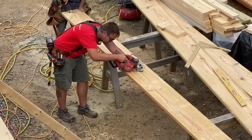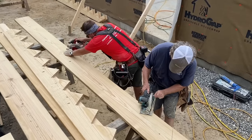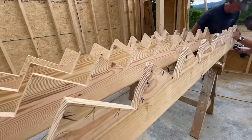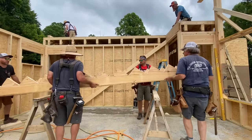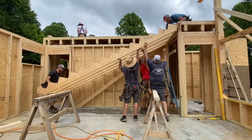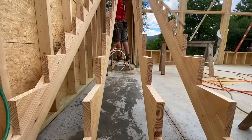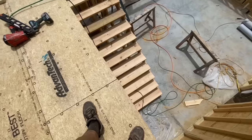After lunch, Jono and Arlo were straight into stairs — and it's pretty amazing to be building the stairs the same day we built the floor. Since this is one straight run of stairs, we screwed the tops and bottoms of the stringers together, made it like a bridge, and installed the whole thing in one piece. We also installed a board against the wall to space them off the wall an inch and a half — this gives room for drywall and a finished skirt board to slide in behind the stair nosings. We made these stairs 44 inches wide even though it's a small house, because I don't like narrow stairs. It's like a super highway from top to bottom.